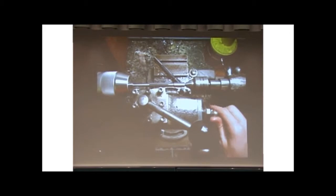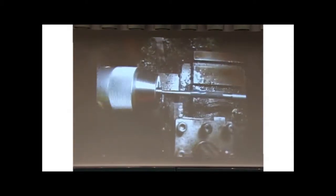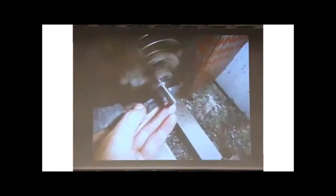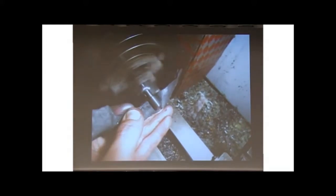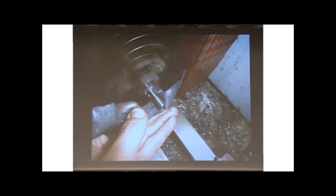The top slide assembly can be rotated to cut arbitrary tapers, so you can make all kinds of exciting things — valves, interference fits, chucks, all sorts. Then finally cutting it off in the lathe with a thin parting-off tool, advancing it into the work to cut it off. You put it back in the lathe the other way around with a different chuck, and you can actually polish in the lathe as well, bringing up pieces of sandpaper and files to shape the work more directly.